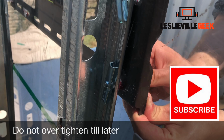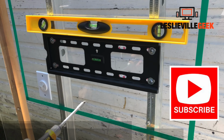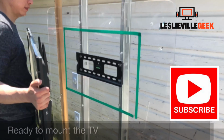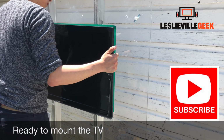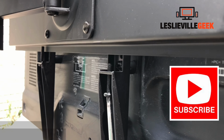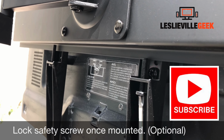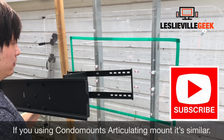So once that is done, you want to put a level. Once you've put in all the 4 screws with your hand, put a level on, and then you can use a power tool to tighten it to the maximum. Not too tight, and then voila, you're ready to mount your TV onto the mount and put in the safety screw, which is behind the TV, to tighten it in place.